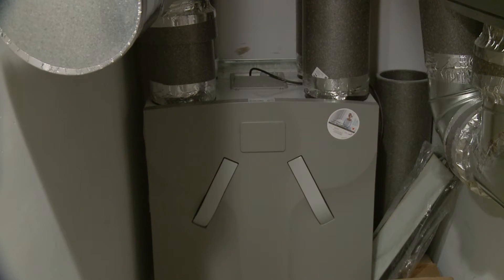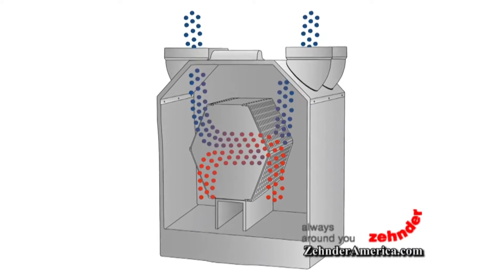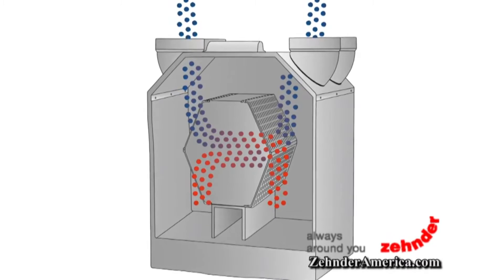The ERV are the lungs of the house. What we want to do is get rid of bad air in the house and make sure we're bringing in good air. But when we bring in good air, we don't want it to be the same temperature as it is outside. If it's 20 degrees outside, we don't want to bring in 20-degree air because it will overload our heating system. In the summer, we don't want to bring in 100-degree air because it will overload our air conditioning system. What an ERV does is trap the energy of the heat or cool in the exhaust air and apply it to the incoming air. It's actually quite simple.